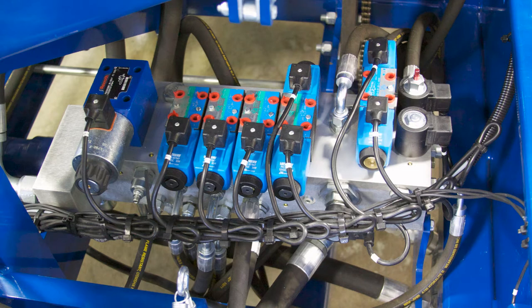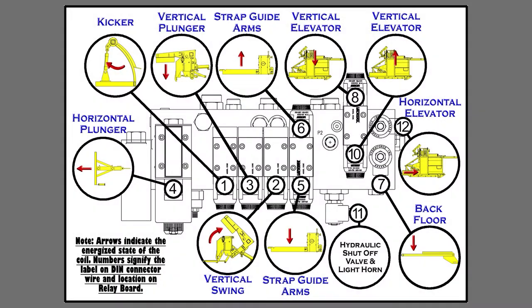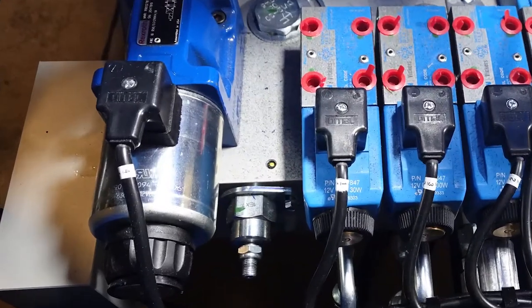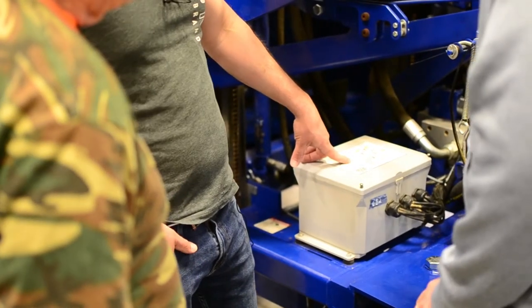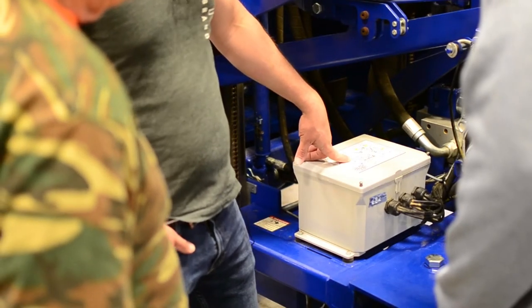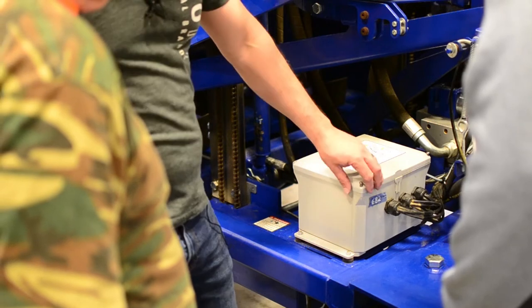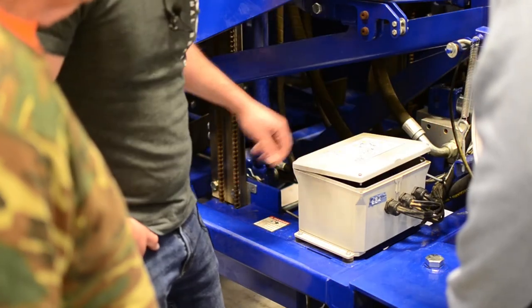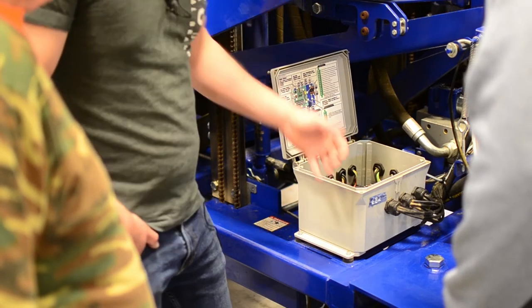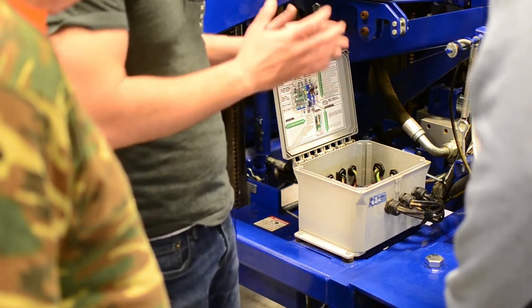That one with two plugs is for your strap guide arms - you want the strap guide arms to be able to go up, down, and hold in the middle. Right here is horizontal plunger, number four. The numbers on the coils correlate with the numbers on the sticker. Green light four is the horizontal plunger solenoid. Input four is red four - so you've got four, four, and four - that is all one circuit. When you're teching this, you know circuit four is the horizontal plunger.